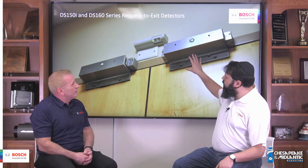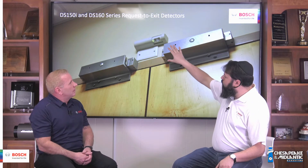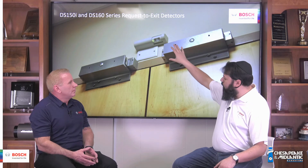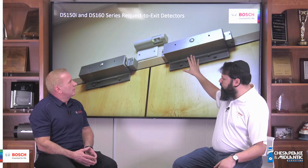Can you tell me how this REX works? So, you've got your maglock, and you've got your power running through the REX, and you have the beam of the REX shooting straight out in front of the door, immediately in the area of the door. If somebody walks close enough to the door that they're intending to leave, the REX will pick them up and it'll cut power to the maglock. The maglock will release, and that's how people will be able to leave freely.